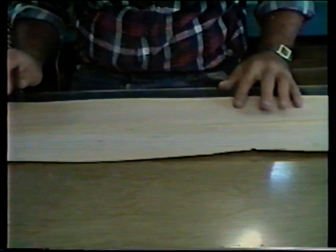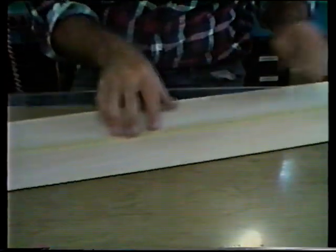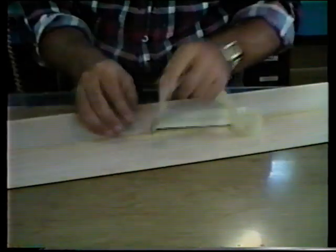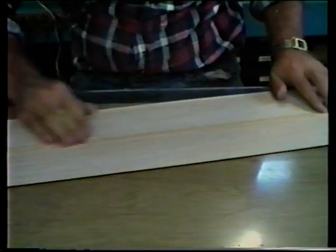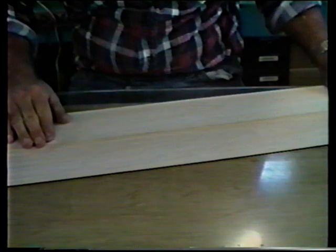Now, the tape is set up about 20 minutes on this sheeting. I'm going to pull the tape off and let that sit for another 20 minutes before we sand it down. If you're using hot stuff, of course, you're ready to go now. You don't have to wait for this extra step. And I'll prepare the cores now. Sand the sheeting with 400, get it final sanded. Usually this has to dry an hour or so before you can sand it down.